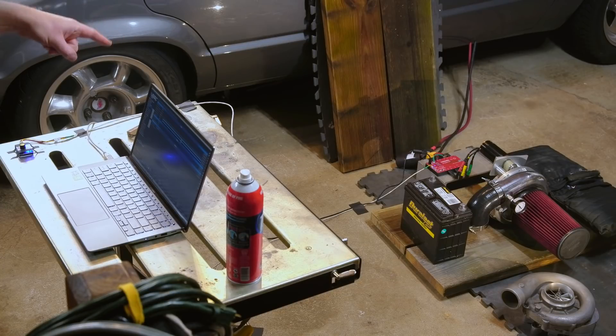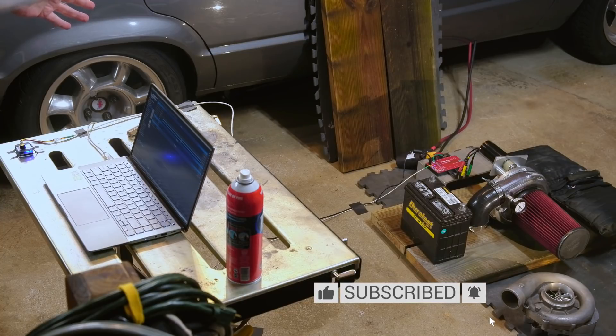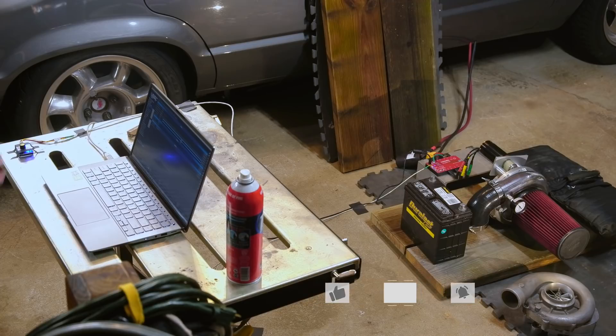The question is: is version two going to work just as well or hopefully better? My big thing is let's see if the VESC stands up and let's see if the belt drive holds up. It's seeing 60 volts — well, a little bit over actually — and we have it set to 170 motor amps, 120 battery amps, and an absolute max current of 300 amps.